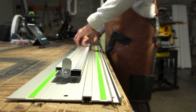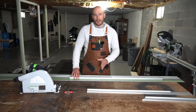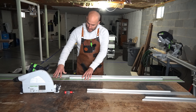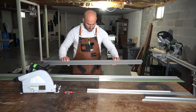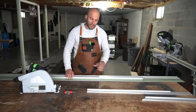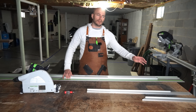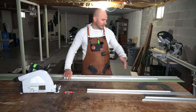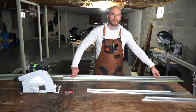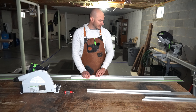I'm going to take our straight edge and align it on this T-track right here in the middle. Because this is my reference guide rail, this is the part I'm going to pull pressure against to get it aligned. You could have the straight edge straddling halfway on both guide rails, but I tend to favor a little more on the untightened side — the side we haven't tightened the screws on — to have a reference point further out from the joint for the best chances of getting this thing in alignment.